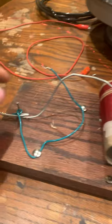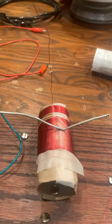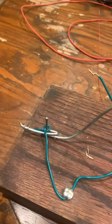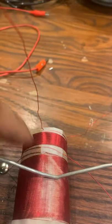The first step is to make a tuning arm that will slide against the sanded part on the secondary. Make sure your tuning arm is made of a conductive material, and on the opposite end from the coil, attach a wire to it. To the other end of this wire, connect the bottom of your primary coil and the bottom of your secondary coil.